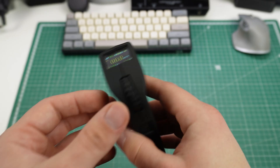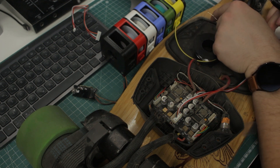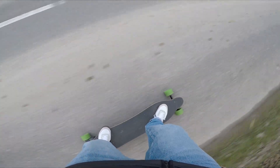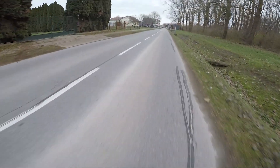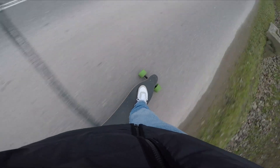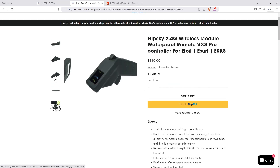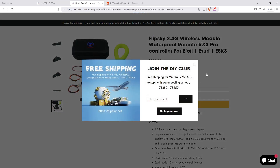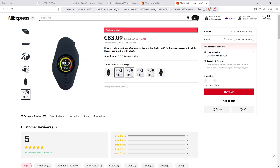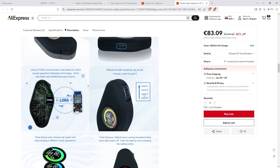For a final conclusion: I don't like the micro USB port, the need to connect your battery directly to the receiver for the battery readout, and the weird speedometer settings. Other than that, this is definitely the best off-the-shelf remote you can get if you want telemetry and don't want to spend more than 50€. Most remotes with telemetry are DIY projects and other options are too bulky or expensive. Flipsky also has the VX3, which is waterproof and targeted at e-foils and e-surfs — much bigger and not practical for an electric skateboard. The VX4 is much smaller and is the upgraded version of the VX2, but it comes at a much higher price, so I think the VX2 is the perfect sweet spot.